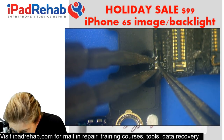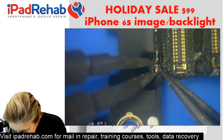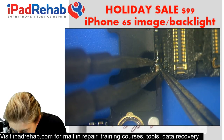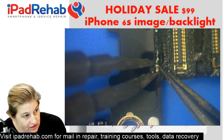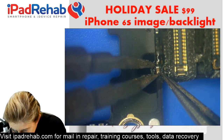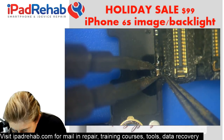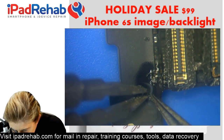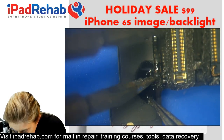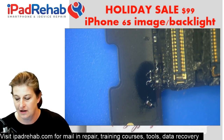It's a little tough to get a cap off with mini hot tweezers when it's on a shorted line, because both sides are ground and ground requires extra heat. But it should come along. All right — cap is off. Now let's find out: do we still have a short to ground?